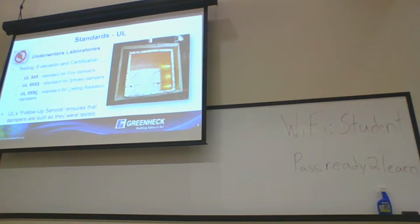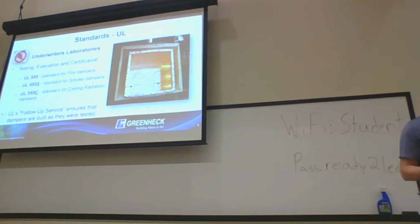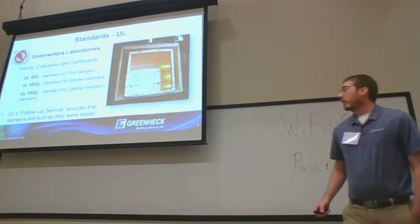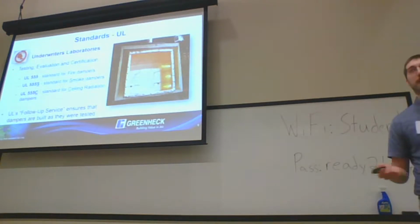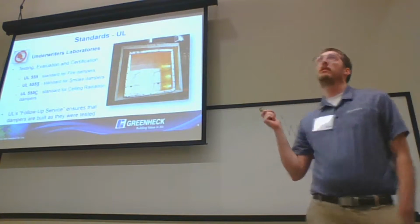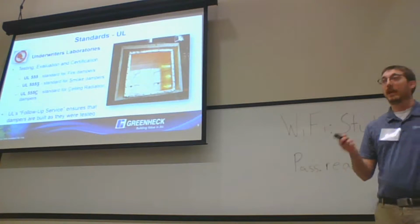UL just says NFPA dictates that. All right, what is UL? Underwriters Laboratories. UL 555 is your standard for fire dampers, 555S for smoke dampers, and UL 555C. What UL does is the testing and certification that a damper will perform in a particular fire barrier. With the UL follow-up service, you can make a modification to a fire smoke damper as long as it matches the way that damper would have been built from the factory.